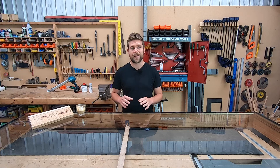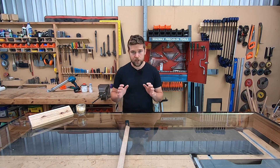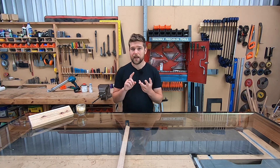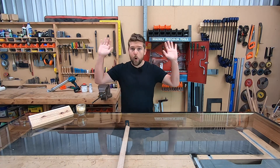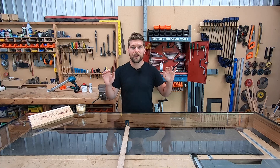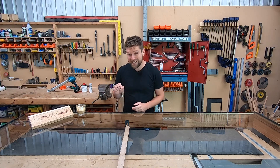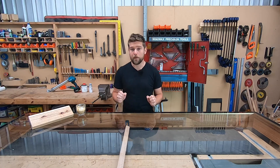So I talked to Sika about what we could use, and they ended up recommending a product called Sikasil SG20, which is a structural glazing silicone. It has really high mechanical strength and awesome elongation strength, which is perfect for what I need - I need to hold a piece of glass up unsupported and absorb movement as this thing is travelling down the road. It's UV stable, sticks directly to glass, and with the right primer I could stick it onto the brass. Perfect.